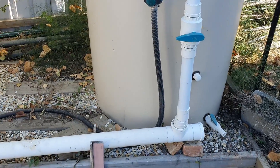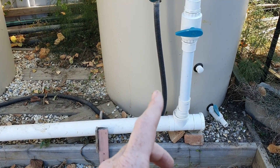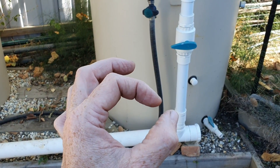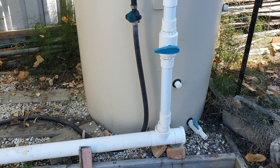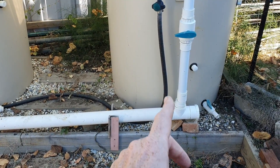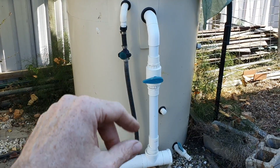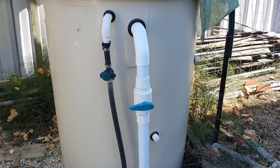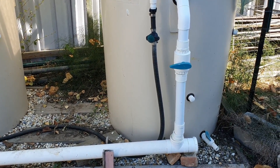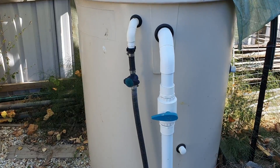With the pipe itself coming to the fish tank, I've gone down from 40 mil to 25 mil — that's an inch and a half down to a one-inch hose — because the pump has an inch-and-a-half fitting. What I should have done is run the 40 mil as far as possible to the tank, then reduce diameter only if necessary, or take it all the way up in the suitable diameter to a valve on the side of the tank. In the new builds, I'll be running smooth bore pipe as close as possible to the fish tank inlet to cut down on flow restrictions.